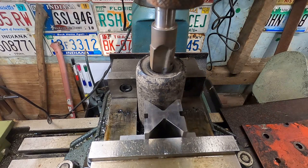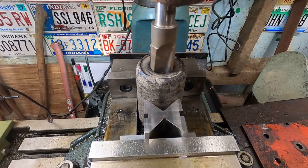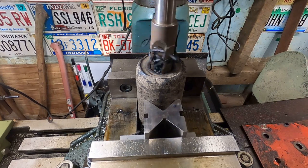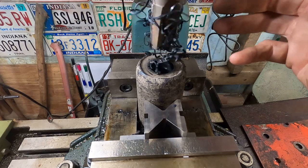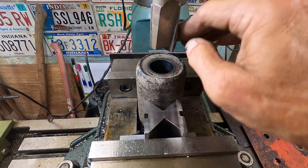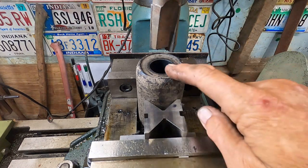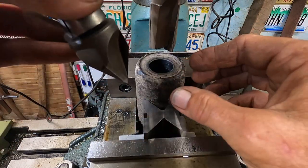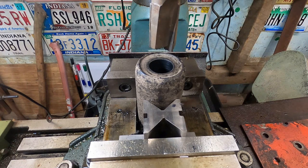Give me just a second and let me see if we can throw some chips out. Now you get to see some chips. That auto feed is going a little bit too slow. I'm using the VFD variable frequency drive. Make sure I shut it off — clearing the chips — and it's leaving a really nice finish in there too. I'm going to go through this side, change out collets, put this in so I can make sure I'm good and centered on the other side, then finish it through using that bit.